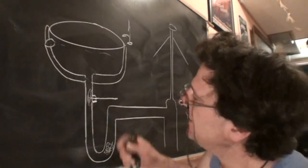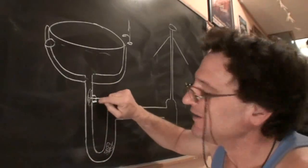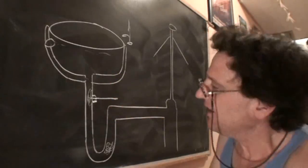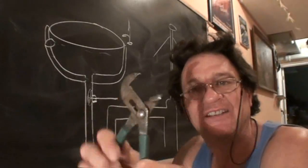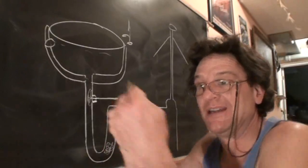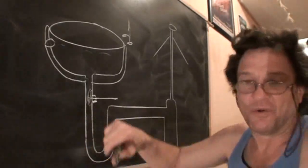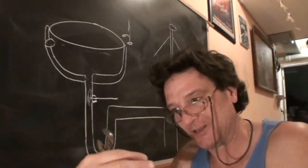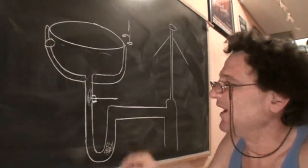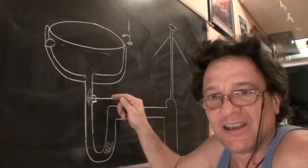The first way is you come in with your hands underneath the sink and reach behind and loosen the nut that holds the pop-up arm in there. If it's a little tight, you could use something like a channel lock to get in there. It's standard threads, lefty loosey, righty tighty, but remember it's in the back of the pipe, so it's going to be reversed behind you. So keep that in mind. Facing it, clockwise would be tight, and counterclockwise would be loose, but it's reversed because it's behind. So loosen up that nut, and you can pull that arm back.